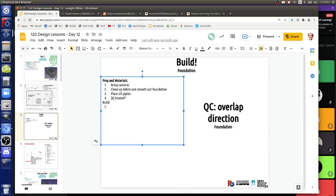One below is a 2x4. One above is a 2x6 version. We'll get those rolls out there. Put on the treated lumber. Place sill plates. That's six of them. 6 times 16. We've got about a 100-foot perimeter, it's a 96-foot perimeter around that. So we need six of the long sticks. They're out there in the piles.